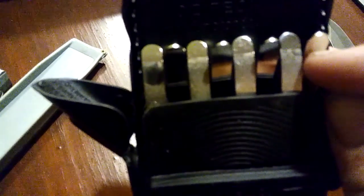Will it work? Yeah, maybe. What I've tested — I ran it through a couple times and cut a few pieces of paper — by the third or fourth cut I lost the edge. So I think all I'm doing is throwing a big wire burr up there. Also, one of the fingers back here has already lost its adhesive on the abrasive, and right there it's going as well. Brand new item, just out of the package. This is probably one that's been sitting in a warehouse on a shelf for a while, bought off eBay pretty cheap. But you can see the quality is junk and it is just not going to last.